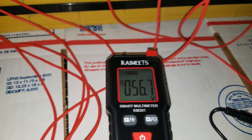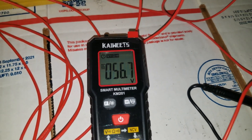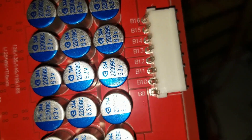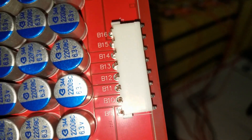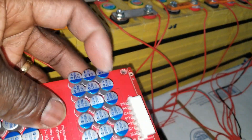And look at it — it reads 56.7 volts total. So 56.7 volts — you've got to be careful and watchful when you do this. You can see where the B minus goes all the way to the 16th connection up here.